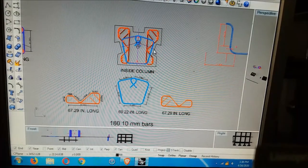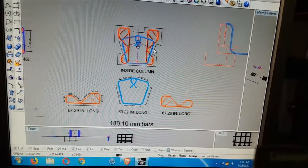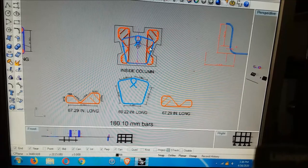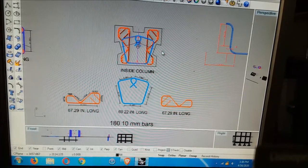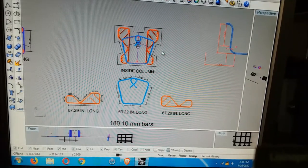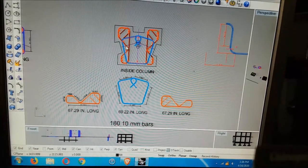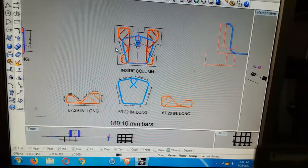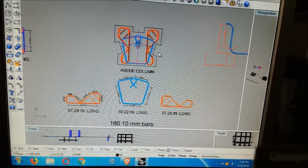And that ties into all the rebar that's in the wall. Of course, those are only in the area where the tie beam is, because we did a poured concrete wall, we didn't bother putting rebars through the column for the whole height of the wall, just where the tie beams go. It's probably a minimum of 6. It was like 10 holes, but when you go to poke them through, they run into a stirrup, or they get over a stirrup and you can't bend them down enough, pushing from the top, to force them into the hole over here. But we got at least 6 in every one of them. And plus, they're all sitting on undisturbed soil.